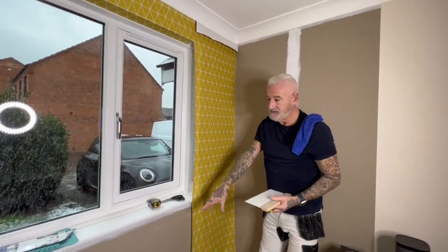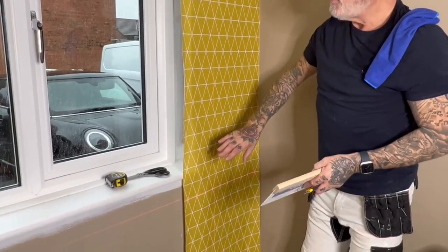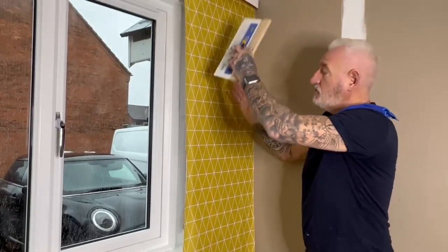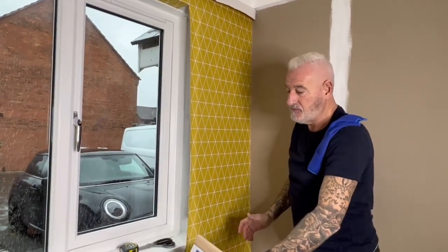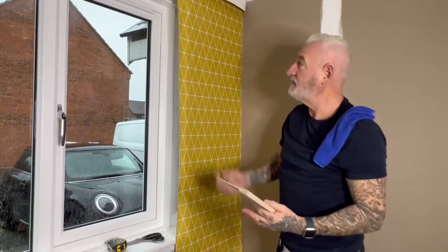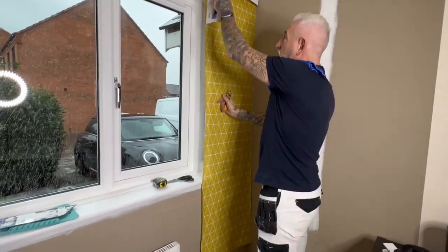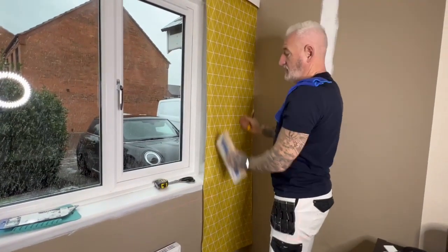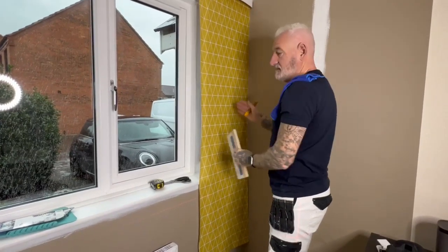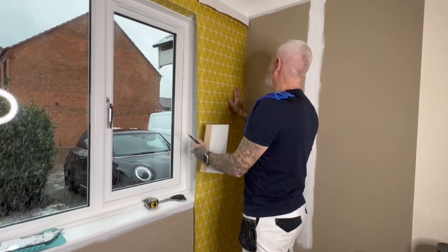In this case, as you can see, there's a radiator under the window. So what I suggest you do when there's a radiator is to come up and across and down and then fill in the middle, because we're going to tuck behind the radiator. With no rad, before I put this length up, I'm going to put our short lengths under the window, across the level with here and then drop our paper in. But with a radiator, I suggest you come around and then come to the middle, over and behind the rad.